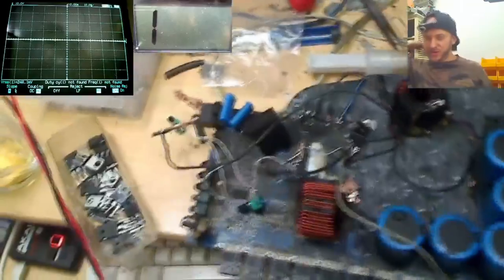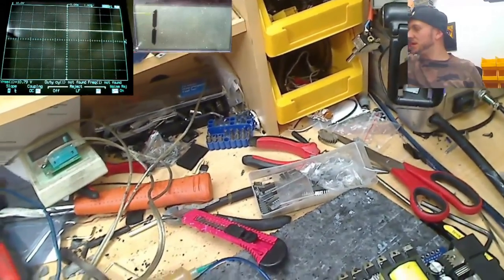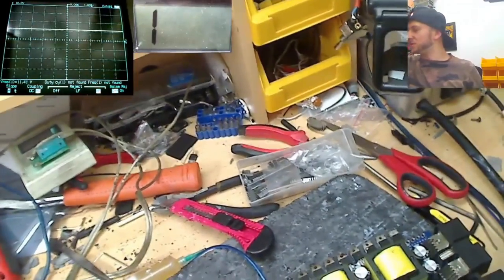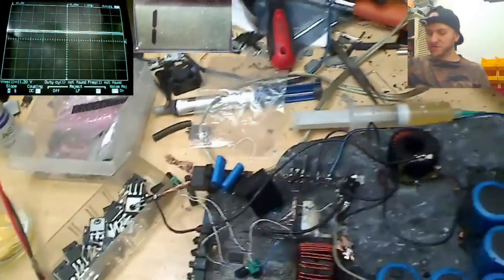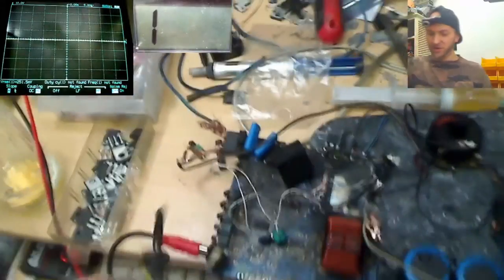Okay, right, inductor is hooked back up. Moment of truth then with turning it on. Okay, so we have a sine wave going in. It seems to need a signal going in now to start oscillating. But as soon as we get rid of the signal, it stops working. If I connect the inductor up after it's already started self-oscillation, then it maintains self-oscillation. Okay, she's up and running. Audio is being produced. Do we have a sine wave? Yes, we do.